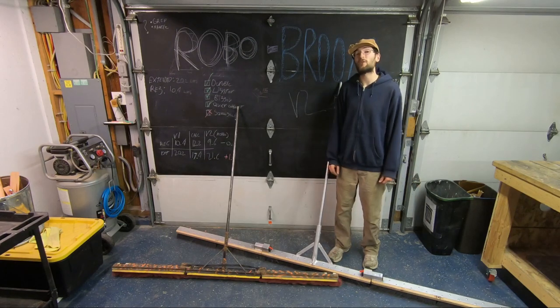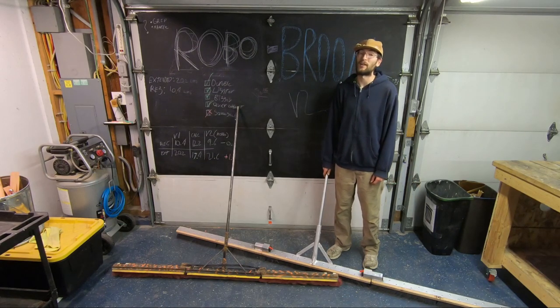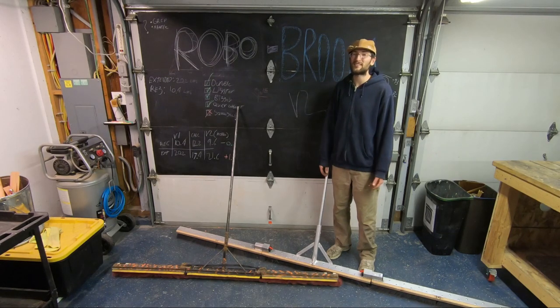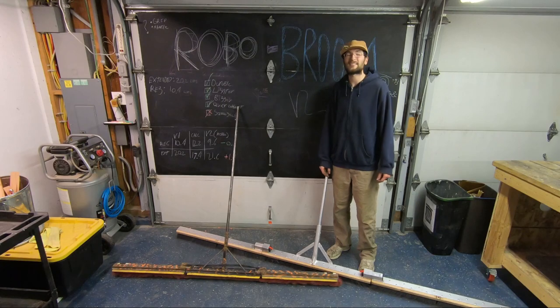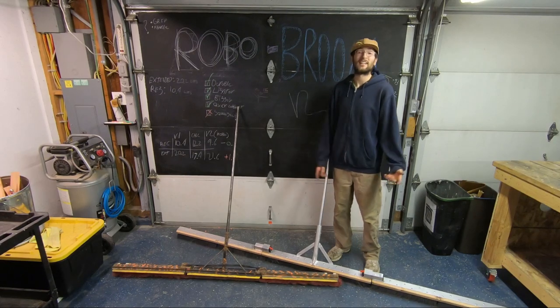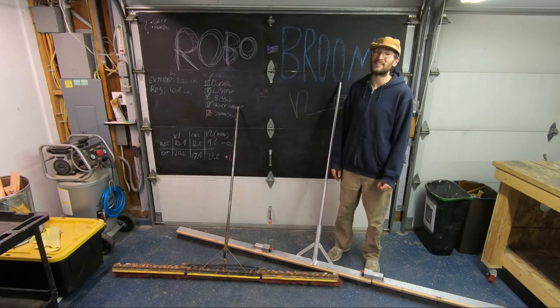Easily, the biggest struggle on this project was the brazing and welding. First, I think this absolutely could have been brazed with tighter tolerances and a hotter torch, maybe something like acetylene or oxyacetylene. But even if it could have been brazed, I don't think brazing would have been the right option. That's why I switched gears and decided to try TIG welding.